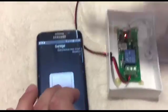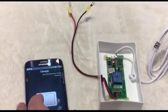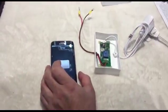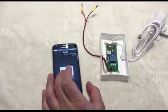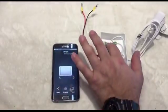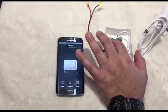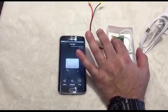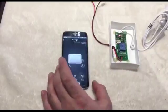The relay LED indicates the connection of the two wires to the terminal for the garage door opener switch. LED two must be off — when it is on, the device is in self-locking mode, but we need inching mode, so LED two has to be off.